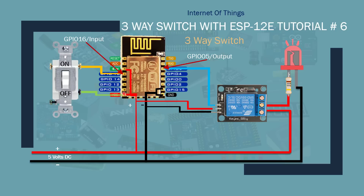At the same time we're powering the VCC and EN pin of the ESP chip with 3.3 volts, with ground going to ground and GPIO 15. The idea is: give a command to Alexa, Alexa turns the relay on or off. If the LED is on and I flip the physical switch off, the LED goes off — all handled in the program. If the LED is on and I tell Alexa to turn it on, it detects it's already on and leaves the relay alone. If I ask it to turn off, it switches the relay off. That's it for this tutorial — until next time, thank you, bye.